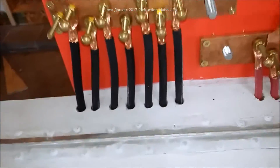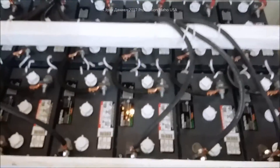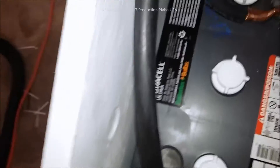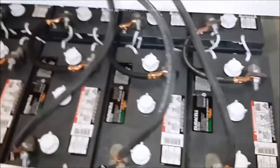At this point we have all the negatives hooked up and all the positives hooked up. Now we have it wrapped up literally — there's the bar in the center, a little recessed from the top. All the ground wires are nice and neatly put on it, and all these wires are equal length so delivery of amperage is perfect. I'm only going to be pulling 200 to 220, maybe 250 amps — 250 will blow a fuse. We're going to cut these and install ANL fuses with one-gauge clamps along here.